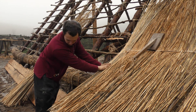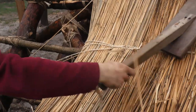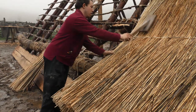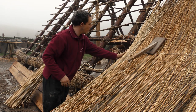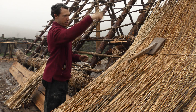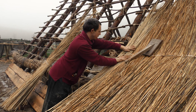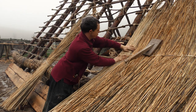Then pull that back down to get it beyond where it was. Then come to the ends, put your hands sort of halfway up, and use the legget to tap it. You're going to want to slacken off where it's tied up here because at the minute it's got a sort of bulbous shape on it, so you want it to be nice and flat. Otherwise you just have a lump on a lump going all the way across your roof. Fan it out and then make a little lump on either side so when you pull it tight they'll squish into each other and make it nice and flat. Make sure it's nice and straight at the top.